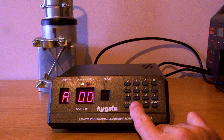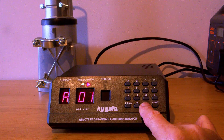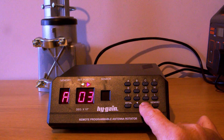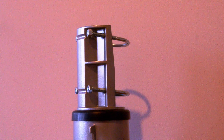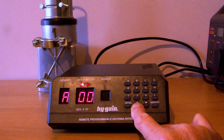On the main control unit there's an Initialize button, which you press to set up and calibrate the motor — just follow the instructions, it's quite simple. Moving over from that, you've got a clockwise and an anti-clockwise button. Hold one of those buttons down and the rotator will turn; release the button and the rotator stops. Pressing the other button moves the rotator back in the opposite direction.